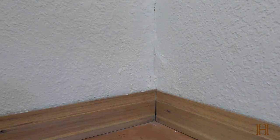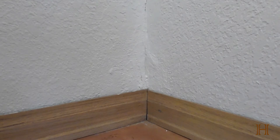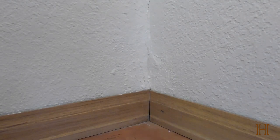So, what do we learn? We are able to make smaller repairs with expanding foam and plaster to put over it. Now, would I suggest doing this in the middle of the wall somewhere or somewhere where you can actually tie into the structure? No, I would not. There I would do the classic repair, but here where you have a wall that was built the way it was built and you're just working with what you got, do it like that.